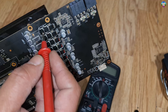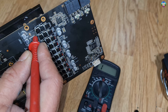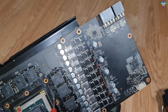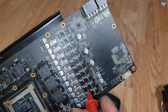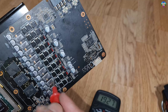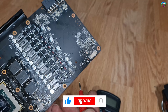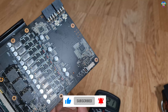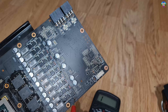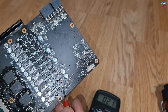I have already tested the other MOSFETs and they look fine to me — no short there, as you can see. Pin number four is there and I'm randomly showing you because I have already tested all of them. These are fine; I don't see any kind of short, no beep. So basically we found the shorts here. I marked already these one, two, three, four, five, six, seven of them — but actually this one is also short, just found it; previously it was not showing any short.